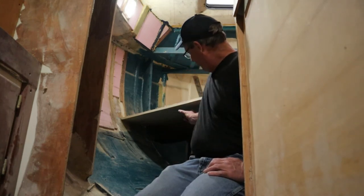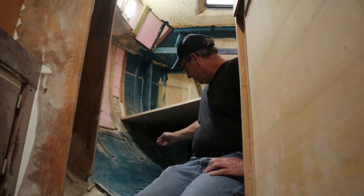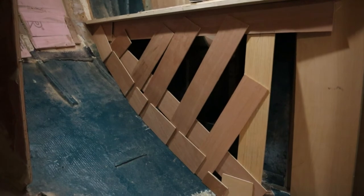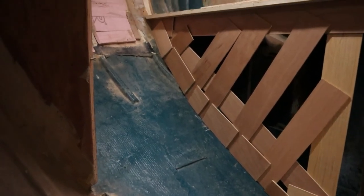So today I'm going to continue with the aft berth. I'm going to be installing a piece of plywood in this area here, basically an inch or two back from the edge of the berth - it'll go down here and follow the contours of the hull. My plan is to make a template out of that door skin, and basically just lay a piece along here, a piece along the top, and a piece down, with some smaller pieces just to show the contour of the hull. I should then be able to lay those pieces onto my plywood and scribe those over. The template's completed - all those little pieces kind of conform to the edge of the hull, and the larger pieces conform to the top of the plywood.